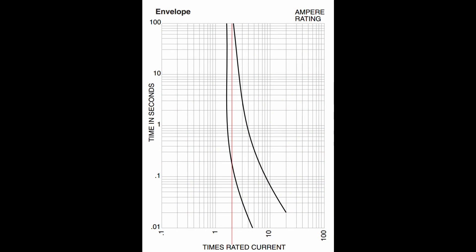Before we go outside and do that, here's a graph giving an indication of the time it takes for the fuse to fail at various currents. I've put a line at the two-times mark — that red line there. So for the 13 amp fuse that represents a current of about 26 amps, and for a genuine 15 amp fuse it would be 30 amps — so certainly in the 26 to 30 amp range. The time to fail falls between the two black lines: at the lower level the lines cross at around 0.2 seconds, which is pretty much instant, and at the upper extreme it's over 100 seconds — coming up for a couple of minutes. This means on a small number of fuses they could fail at any point within that area, between less than a second and a couple of minutes, so the time to fail won't tell us a great deal.